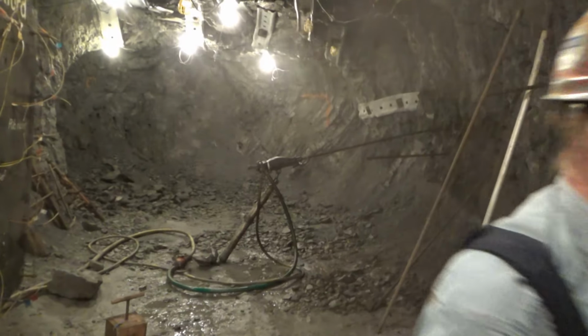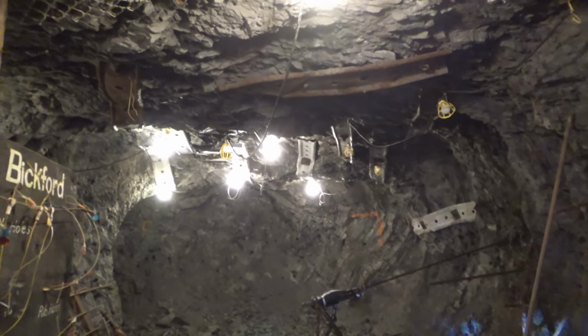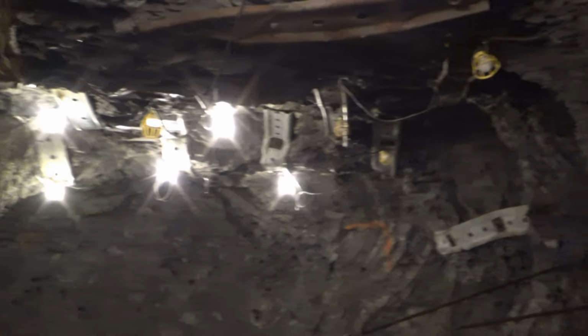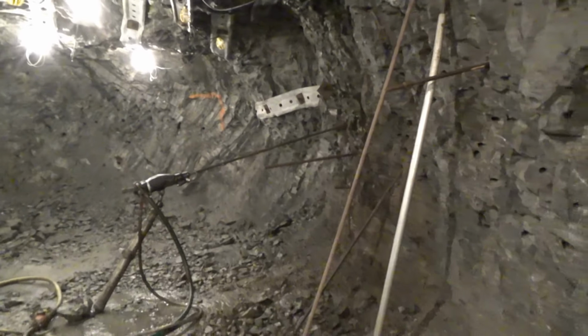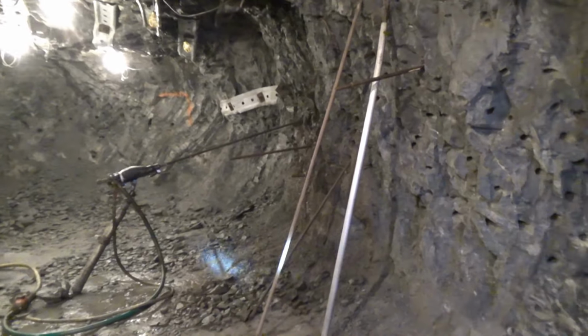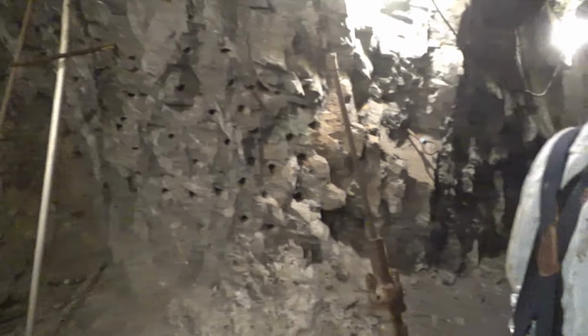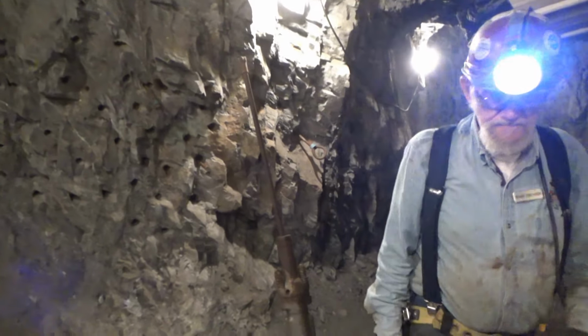I'd like to run that all day. A lot of days miners run that all day long. When I was younger, I could drill a pattern like that in about 4.5 hours, but I worked in veins as wide as that. And if you're in a vein that wide, even if you're really good and really efficient with that machine, you'll be drilling at least all day for 3 days to break out an area that big if you're in there by yourself. And most miners are always working alone, so that's how much you'd have to run that machine.